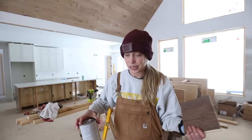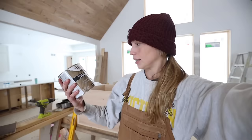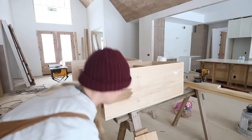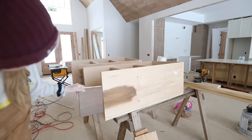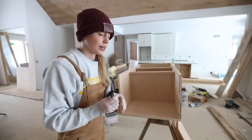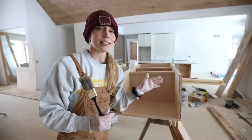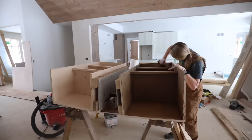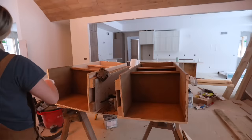We want it to go dark and match our hardwood floors, so when we went to the store, we put the stain up next to a sample and got a matching stain. This is Varathane Western Oak — it's an oil-based interior stain. First thing is to test it on the side where no one will see it, just to make sure we're happy with the color. Then get all the nooks and crannies with the brush, use a paper towel or rag to smear it all over, and see if we need another coat.